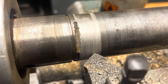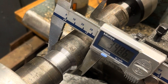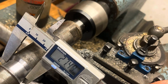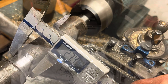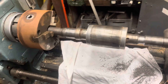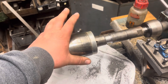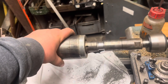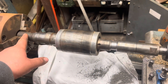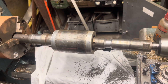Hi, it's Brad from MJB Engineering. I've got another shaft repair video for you and this one has had quite a few repairs before by other firms. You've just looked at some photos of some spray welding that actually failed. That's the void left after removing all of the spray welding — it's 3.75mm deep, and that's deeper than any spray welding should really be carried out. I've got a powder that'll do 3mm, but anything over that there's no guarantees. But this shaft is scrapped without it.